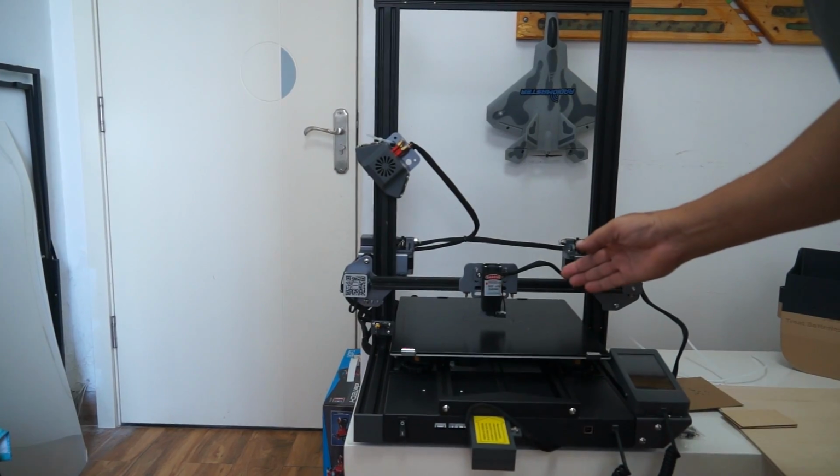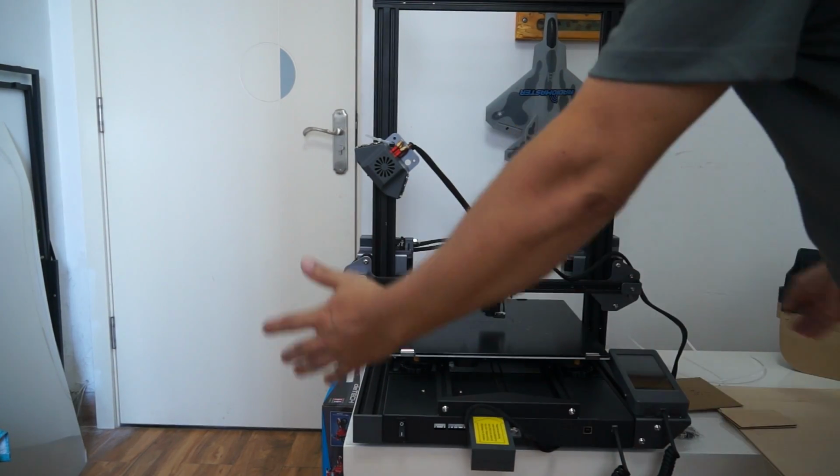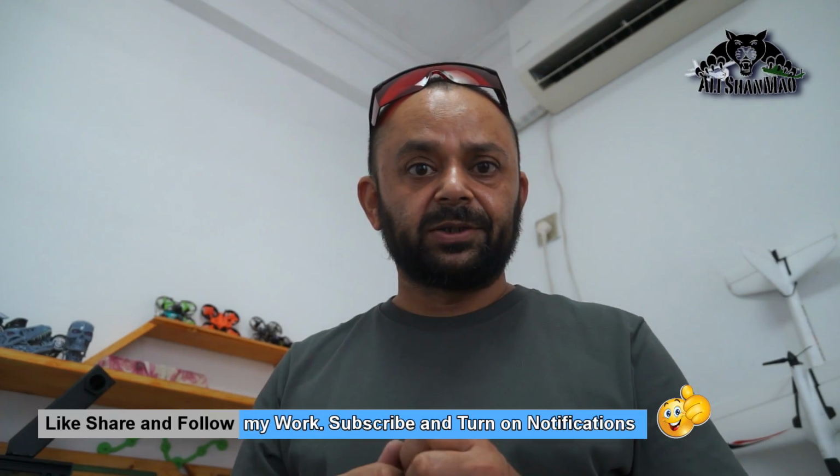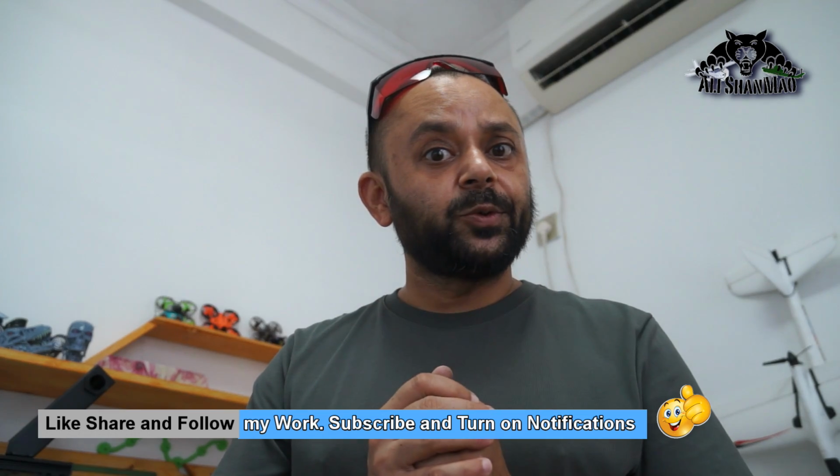Now take the TF card to the computer, turn on the Lotmaxx software, and engrave and bring in the image or whatever project you want to laser engrave. Make a file, save it on the TF card, and bring it back down here, the Shark Plus, which is now your huge laser engraver machine. Choose the file using the LCD screen, and you're good to go.